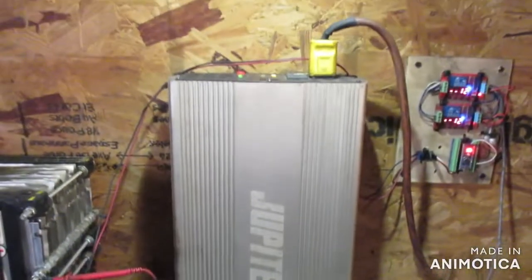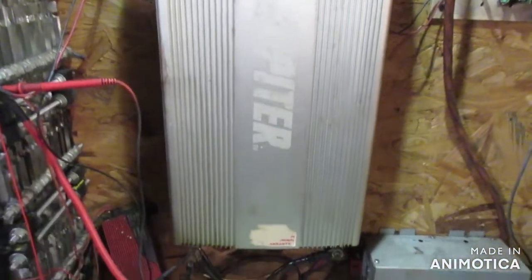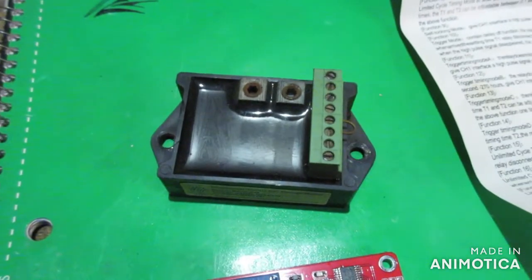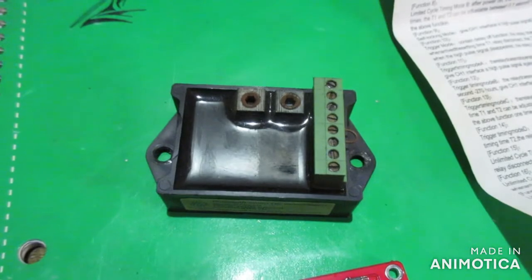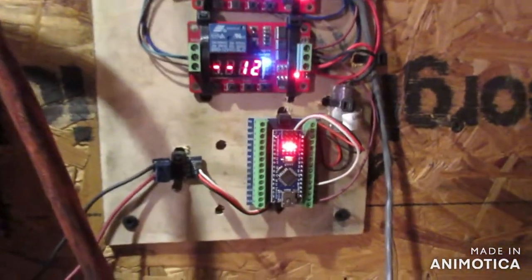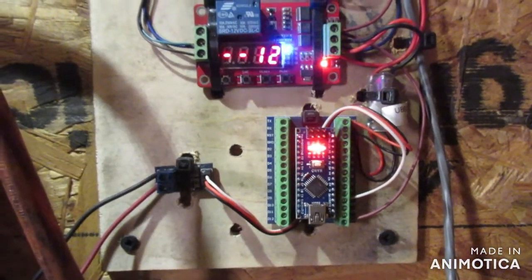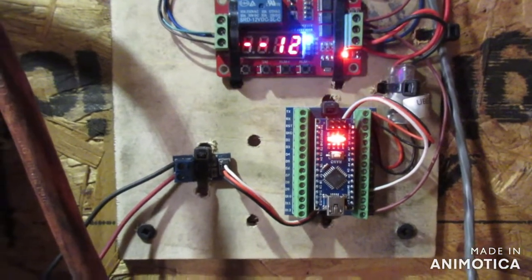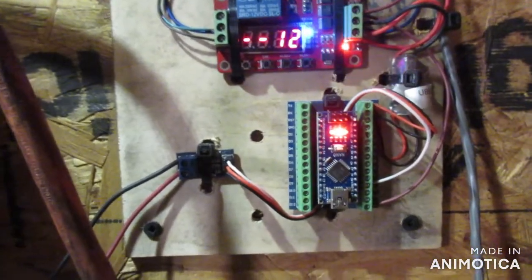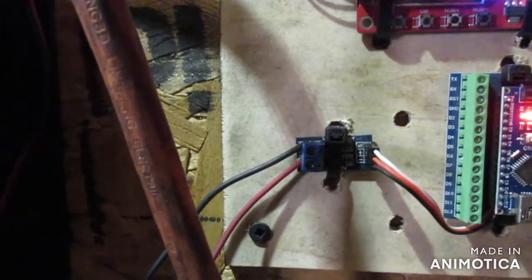Now if you don't have that — this is a Harbor Freight inverter so it does not have a built-in AGS. You could get a Thorn Wave, and that was my intention for this video, but it was working yesterday until I mis-wired it, let the smoke out, and it no more worky. So I had to build an Arduino controller, which is fairly simple. I'll detail that on the forum — the code will be there. It's just got one input and one output and you program it with the code I provide. I have a voltage divider there so I get voltage coming in from my battery bank.